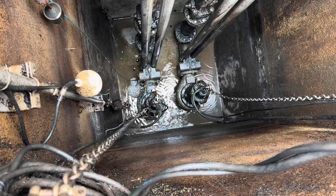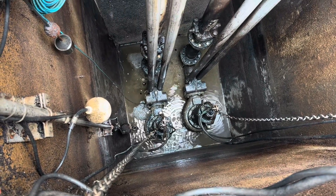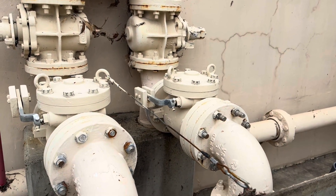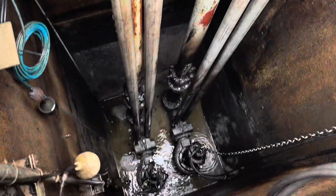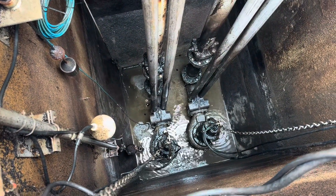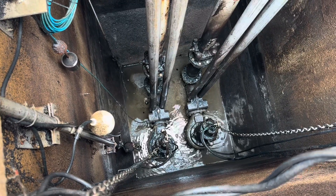The lift station is empty for the most part. You can see there's some water entering here - that is a back feed from that check valve right there, which means I'm going to have to rebuild it or at least open it up, clean out the seals. That trickling you're seeing is back feeding. When we get into valves, I'll break apart a check valve and talk about that.